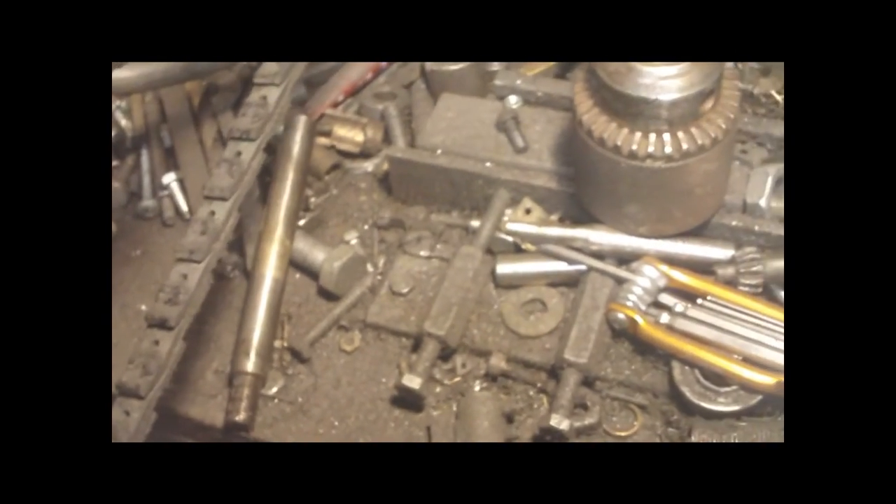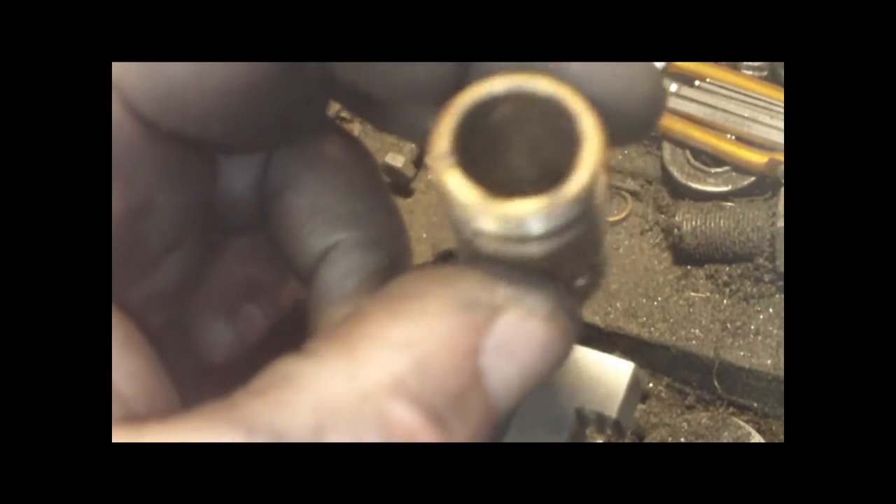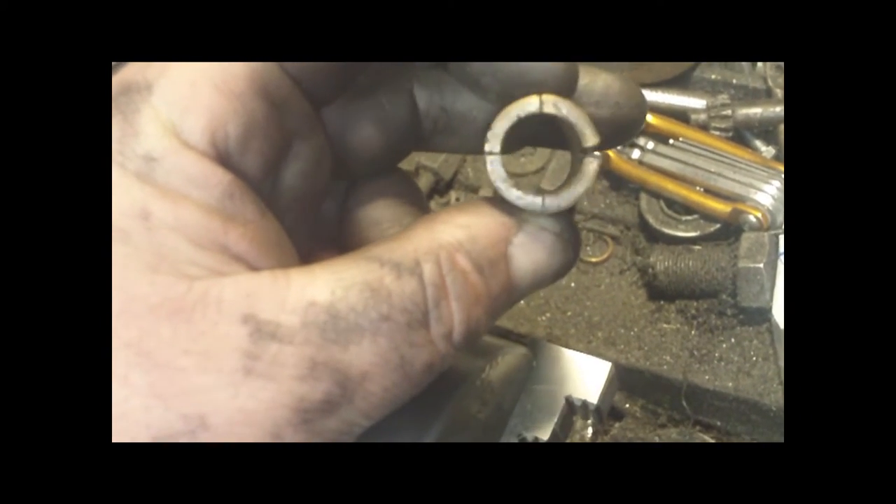The old style had this little split bushing in the front — it's more of a collet than a bushing, it's got four slices in it and just squeezes around the shaft. Well, these wear out pretty fast and then you get headstock movement. So I got rid of it and put a bearing in the front. I'll probably eventually do it in the back too. I modified the headstock for my purposes, but these headstock castings are very available and I've got three of them.